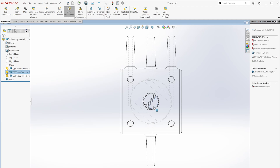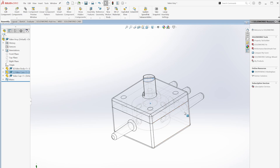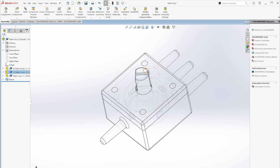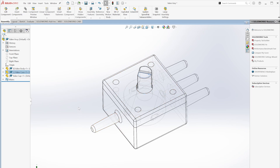In the pressure position, it allows for inlet air to come in through this port and then back into the pump. I'm hoping this is going to work — I'm quite excited about this project. I think students are going to have a lot of fun making little pneumatic actuators move. The last piece of this puzzle is to build a little bell crank that I can slot onto this spigot, which will allow the valve to be controlled by a servo motor, giving full control of a pneumatic system with a pump connected to a relay.